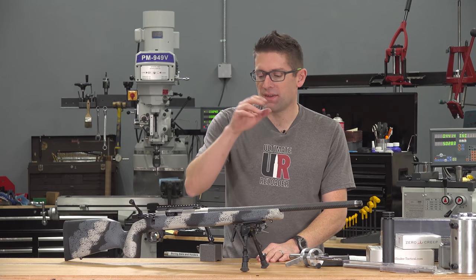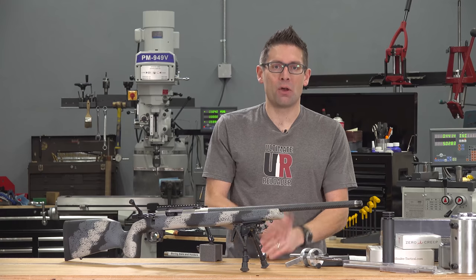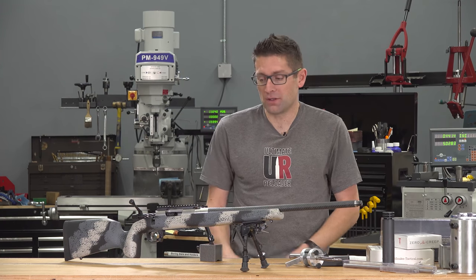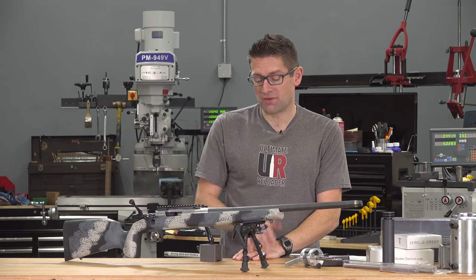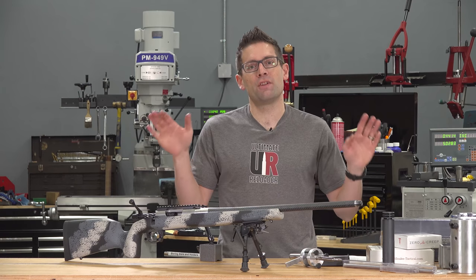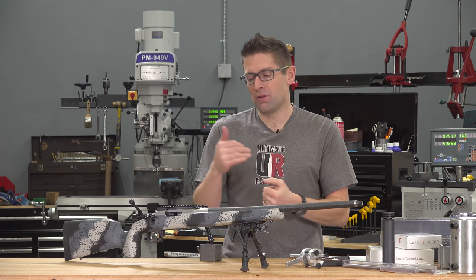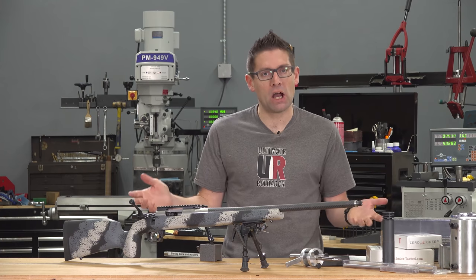The action closed on the go gauge and would not close on go-gauge-plus-two, and would not close on the Manson no-go gauge — which I've measured to be typically about five to eight thousandths longer than the go gauge. I also applied something learned from Gordy's class: do visual checks when done, just to make doubly sure you didn't forget anything. Check to make sure the case is fully supported up to the point where the extraction groove starts. If you do your math wrong and have too much unsupported chamber, that's really where you run into trouble — one of the main causes of people blowing up guns.